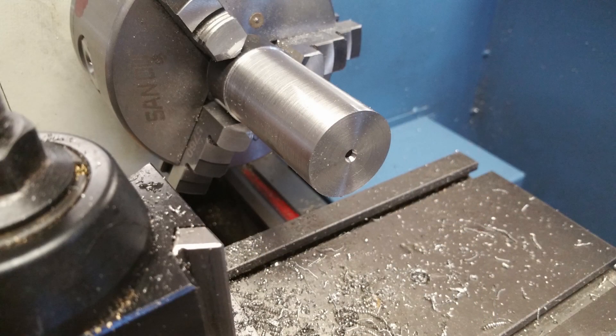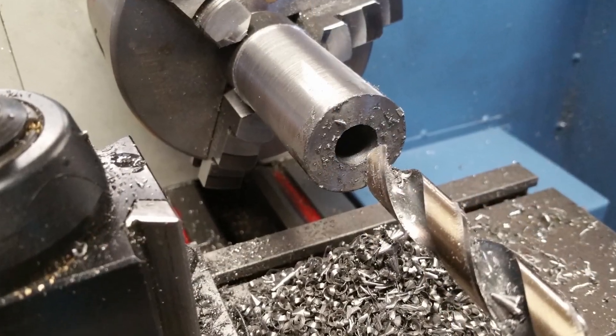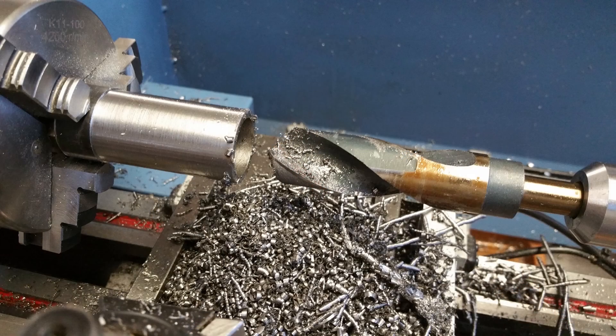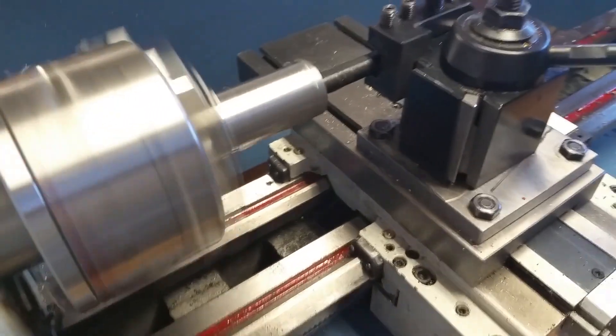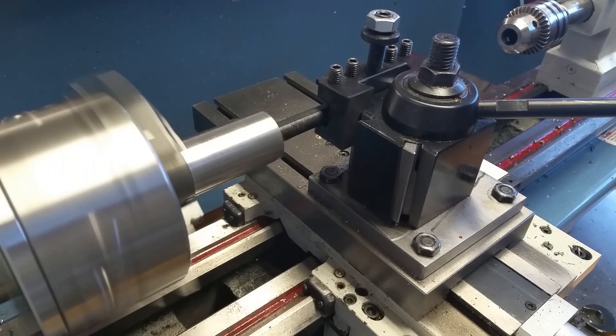As we watch this montage of drilling out the internal bore with increasingly larger drill bits, we need to decide whether we machine the bore from the top or from the bottom of the cylinder. The advantage of machining from the bottom is that we'll be able to test fit the block onto the cylinder as we approach final dimension. However, when boring a hole on a small lathe using a long stick-out on a boring bar, it's inevitable that the bore closest to the chuck will be of a greater internal diameter than the bore furthest from the chuck, no matter how many spring cuts we make. It's advantageous for a cylinder bore to be slightly tighter at the top than at the bottom — only by two or three thousandths of an inch — so we're going to bore from the top of the cylinder.